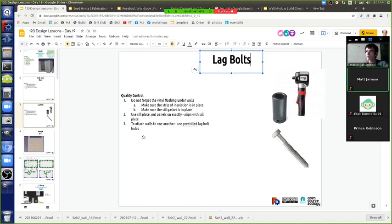Otherwise you're putting force on one side while trying to pull on the other - a coordinated effort where you can't see the other person because of the siding. It's easy to coordinate if you just put that centering hole in. For good quality, you want alignment within about an eighth of an inch. The lag bolt holes can be drilled precisely to within an eighth inch using the mag drills.